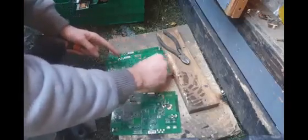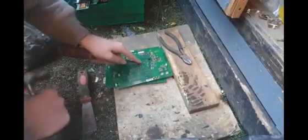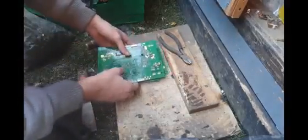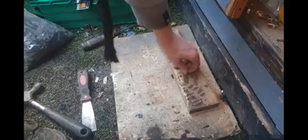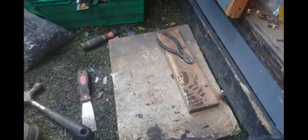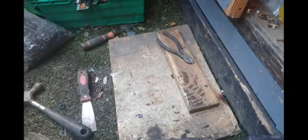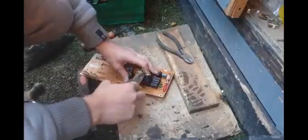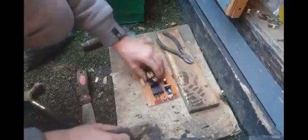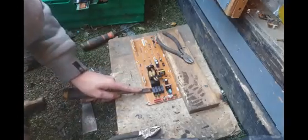Well, these are probably in the top couple of best things on the board by weight. Out of the common things, this is probably the second best thing. Best thing being obviously the gold corner BGA tops, because they get about 10 grams of gold per kilo, based on what I normally get, sometimes a little bit more, sometimes it's nothing. It's kind of a risk when doing them, but these ceramic oscillators are about anywhere between 5 and 10 grams of gold per kilo. And then next best thing is the old style MLCCs, which is about 8 grams of palladium.